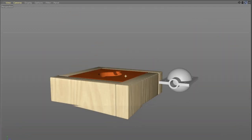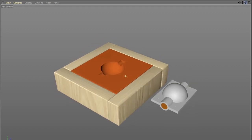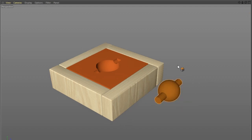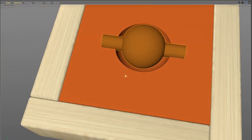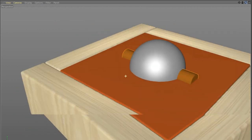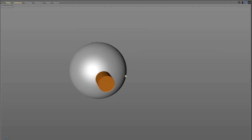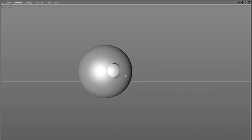Next, the mould for the sand core is assembled and filled with core sand, which then sets to make the core. The core is removed from the mould and placed into position in the flask. This leaves a nice void to fill with the molten metal. Molten aluminium is poured in and the flask opened to reveal the final part. Finally, the core is dug out of the part and there we have a hollow aluminium sphere. Easy, eh?